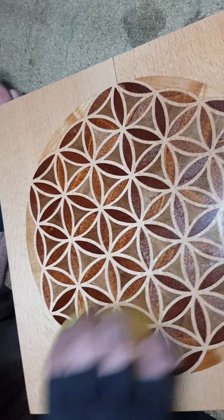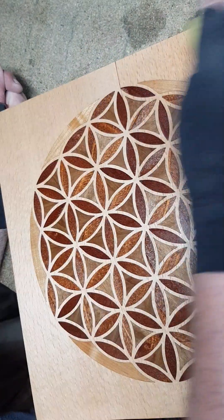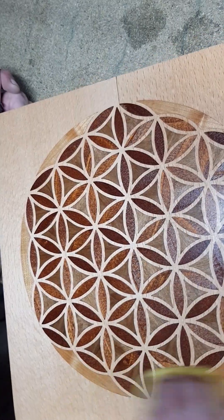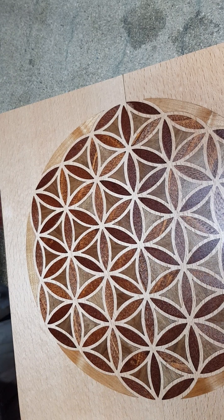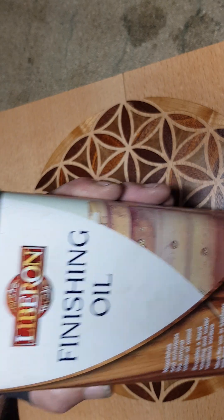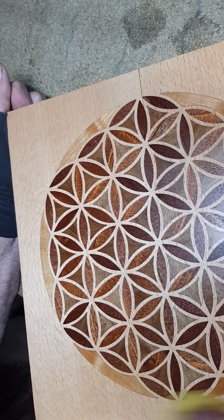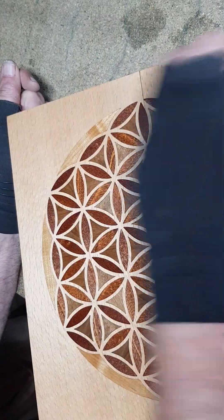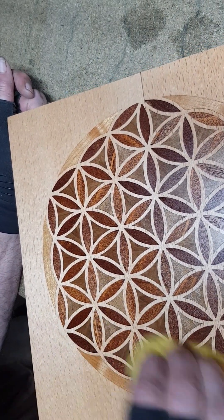It's nice to put wax on — put the oil first. Wax does bring the coloration out and makes the grain pop a little bit, but I always put oil on irrespective of whether I'm giving just oil. This finishing oil — you can see that's what it's called — very good stuff. You can just keep putting it on one coat after another, with a very very light wire wool between coats. Let it dry for 5 to 6 hours, then a very very light going over with wire wool — triple grade quality, quad grade 4-0 wire wool, very fine.